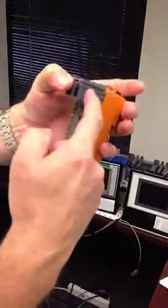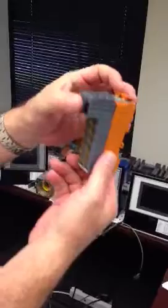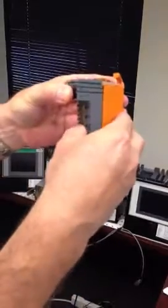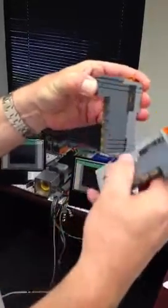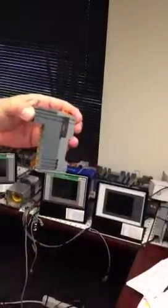Now we're going to remove this slice and the base. It's hooked to the DIN rail inside the blender on the back here. So you have to push this up and then grab this assembly, leave this one in place, and slide that forward. And it comes off from the one to the left with these little slots that engage the male pieces on here. It goes back together that way. So keep that assembled and put it to the side. We're going to put it back on.